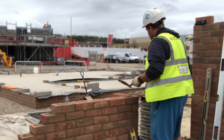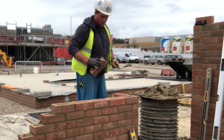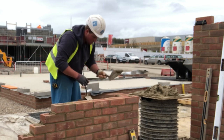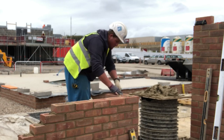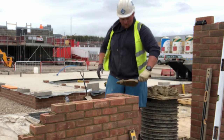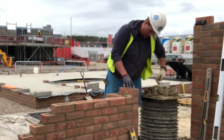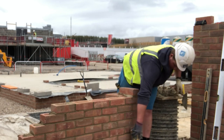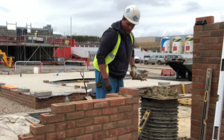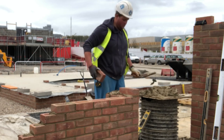It's really good for the pick and dip. I set up the boards — as you can see, two boards on this corner — and I use the six-foot levels, tailing out ten bricks long, to get a 20-course corner. The gable right next to where I'm working on the house is 20 course, so I just matched that with the garage. Hopefully I had a big enough gap between the garage and the gable to easily get scaffolding in, because sometimes scaffolders will knock a couple of bricks off your garage when they're putting the scaffold up. On this site the scaffolding system they use is pretty versatile so it can get around these openings quite easily.